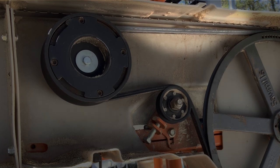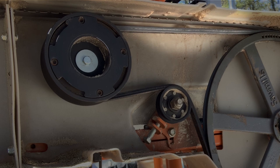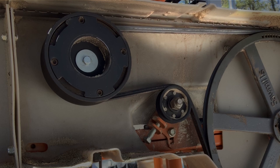Oh, you see it move? See it move? Right there. So, as soon as you watch it come flat, then you set level on your T-handle, then you can start your count. So again, don't start your count while it's up here because there's not enough pressure on that spring. But once you see it move, now you can level out that T-handle and start your count. So let's put 6 full turns on this right now.